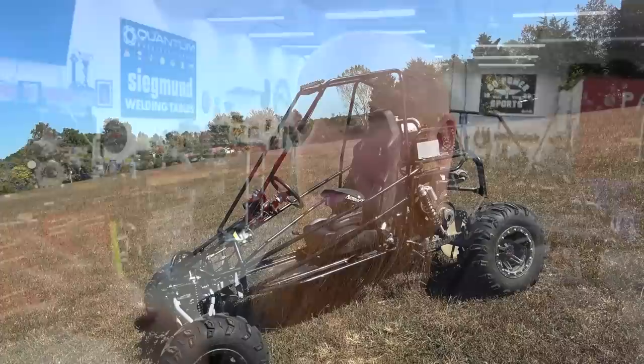With this Yerfdog, he's going to do independent rear suspension and a differential later, but right now we don't have the time to do that in our shop. So what we're going to do is pull this thing in. The 40 series torque converter is really underpowered for that 625 engine, so the pulley keeps getting stuck. So we got on the horn with Go Power Sports and got a 780 CVT. We're going to build a jack shaft setup just like I did for Gravy Bones, and we might even do a jack shaft setup as well to do the gearing reduction so we don't have that massive sprocket on that swing arm.